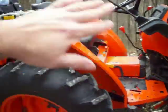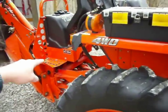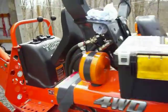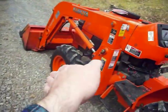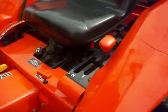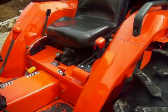If you use the loader valve, everything else is dead. Like if I angle my plow and raise it at the same time — you can see my plow video for how I got it rigged up — the angle cylinder runs off the aux valve. Like I said, it has that third low-pressure return that goes down into the casing. There's a swivel in there I just screw out to add fluid. Also, if the tractor is tilted — left front down — the suction is on the right side at the rear and sometimes it will make a whining noise because I think it's sucking air, and you don't want that.